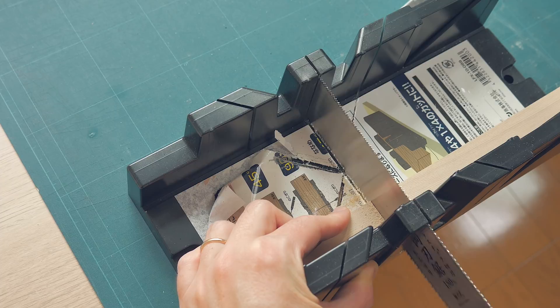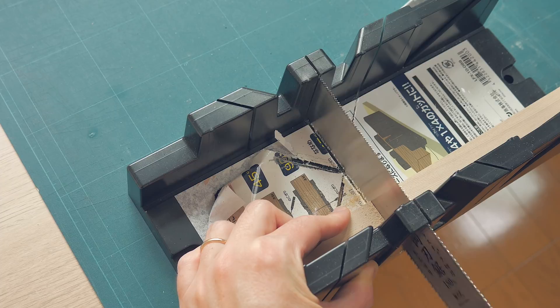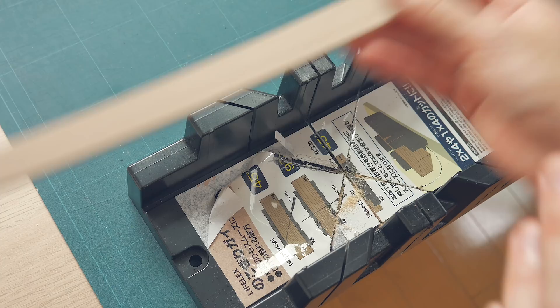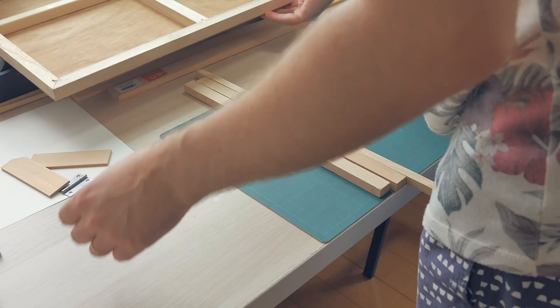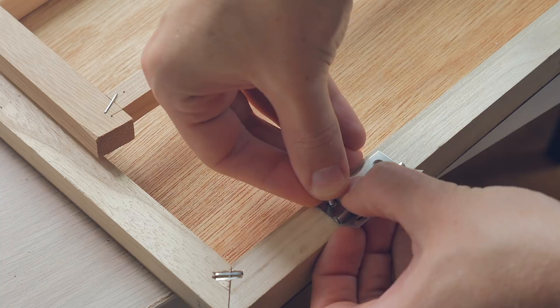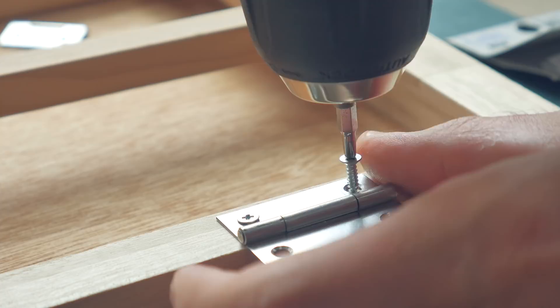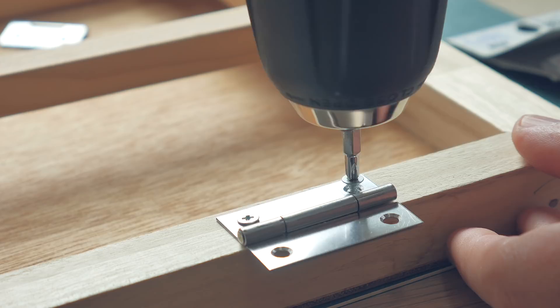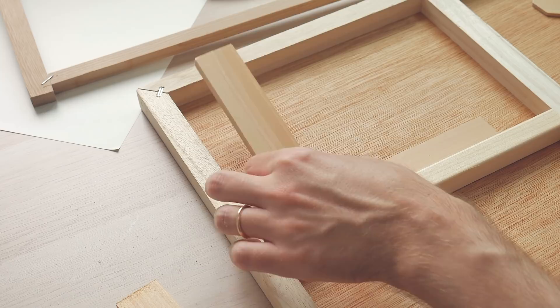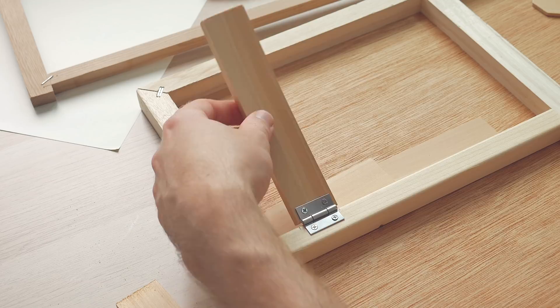I started the process of converting this board into a drawing board by adding a bar that will be the pivot point supporting the arm that will support the whole board at an angle. I wanted to be able to adjust the pivot point so I didn't glue this bar in place at the beginning — I did it as the last step. Next I built two frames: one that will support the whole thing on my desk, and a second one that will be the arm supporting the board at an angle. I was conscious about keeping them as wide as possible for stability, but also compact enough so the arm frame fits inside when folded up.